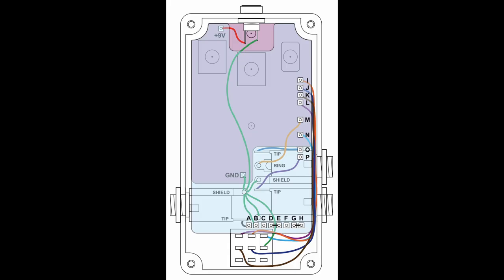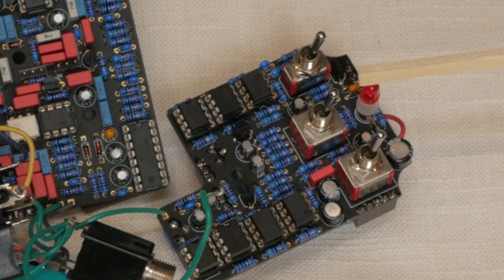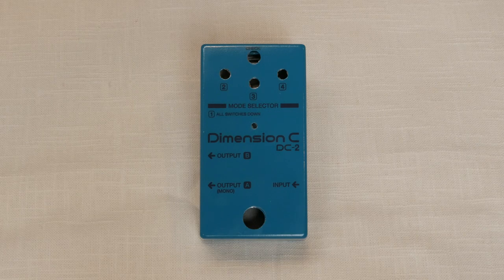For this build, I chose to go with the stock bypass method which mimics the signal path for the original circuit. With stock bypass, the signal passes through pre-emphasis and de-emphasis filters. The last parts I'd like to highlight are the SPDT and DPDT toggles. I used mountain switches that are recommended in the build guide. They feel nice. Finally, let's take a look at the enclosure.